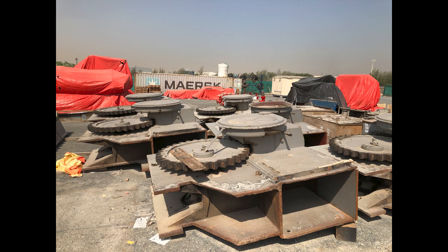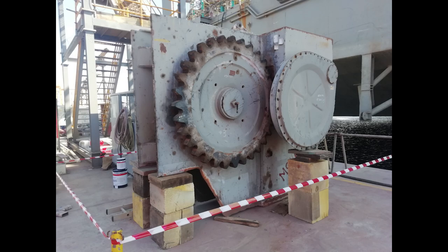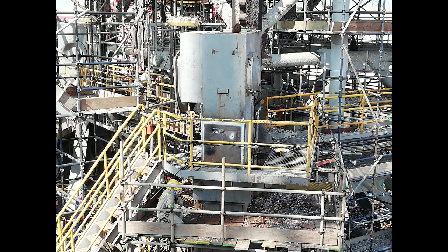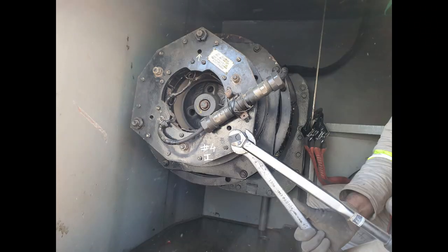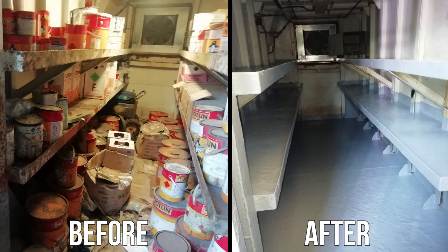Four pinions are installed on the inboard chords as fifth layer for the port and starboard legs. This was done to take account of the additional environmental loads on aft legs. Paint locker is refurbished as per ABS rule.